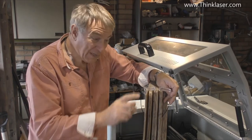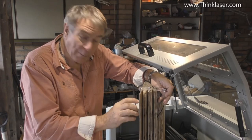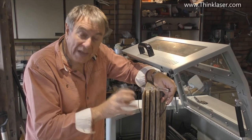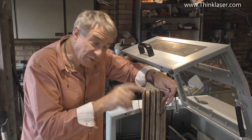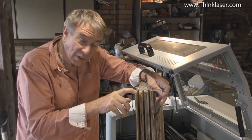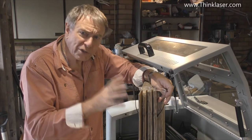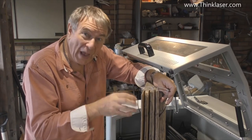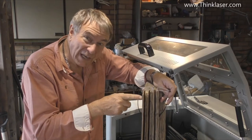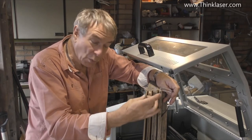There are two major problems when you cut cardboard. The biggest problem is the air gap between the sheets. The first layer burns and produces smoke; that smoke absorbs energy and makes it more difficult to pierce through the second layer. When it does pierce through, there's even less energy and more smoke in the cavity beneath. To overcome that you put lots of power in, but the more power you use the more likely you are to actually set fire to the gases between the layers.